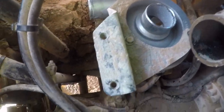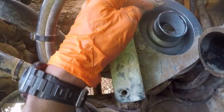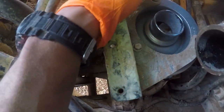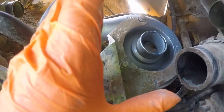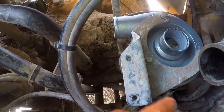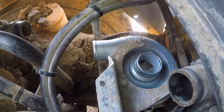We'll hook up all of our hoses and then we should start feeling cooler. One more thing — we've got our bracket on here. These three bolts are what's going to put tension on the impeller and keep it pushed down. You don't want to just run these down all at once — you want to run them down evenly so it tightens up squarely, like putting a tire on a car. You want even pressure. Don't just go crazy and run these down with an impact and call it good, or it'll probably start leaking.